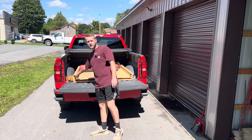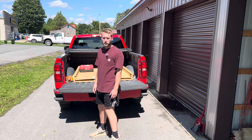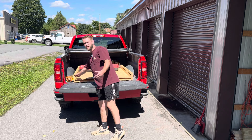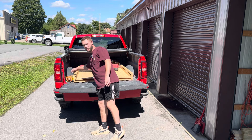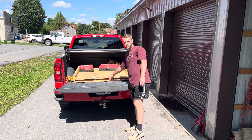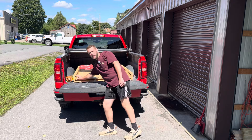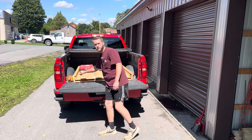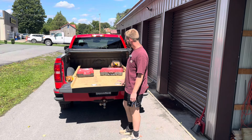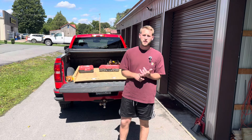On the sides here is a ledger — just a one by six deck board, standard deck board. I screwed it from the bottom, then put a little lip here. I ripped down a scrap deck board to one inch and put that here, mounted into the piece of decking. Then you take your next piece of plywood, cut it down to size to fit within the side brackets. You rip another deck board, leave a little gap so it slides — that's what allows it to operate. I just put two little handles, and that's it. That's how it works.